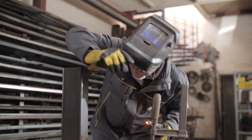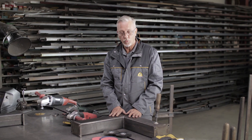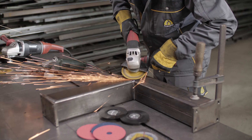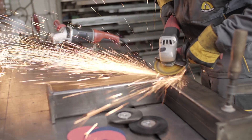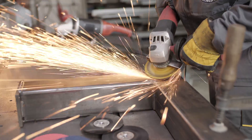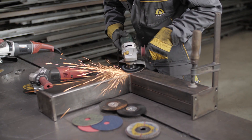The next part of the process is removing the welded seam to bring the welded joint to the same level as the parent material. We have two options. We have a traditional grinding disc, which is a two-step process. We need a grinding disc and a fibre disc to create the finish. The grinding disc takes the metal away very quickly and efficiently, but the risk is undercutting below the parent material. So I'll initially take the metal down to level with the grinding disc, followed by the fibre disc for the surface finish.